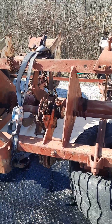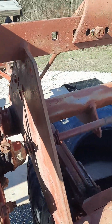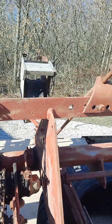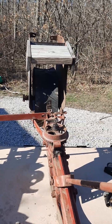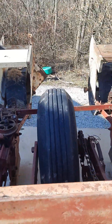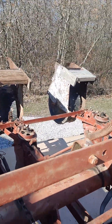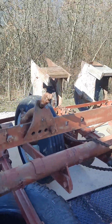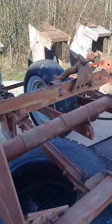In this first episode I'll pull that old marker assembly pulley setup off — all that's going to go away, along with the old chains that don't do anything. They like to hang down in there, which can be bad. I'll also get rid of those rear hopper side plates. I won't be using insecticide bins or fertilizer bins on this one. I believe the previous owner had his kids sit on those — they had little seats on there and would chuck seeds in every couple feet for pumpkins that were bigger than the seed plates they had.